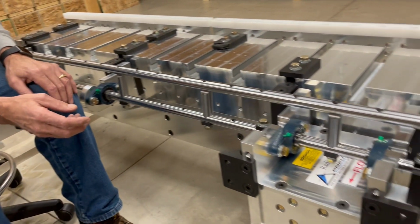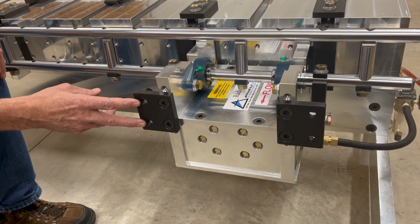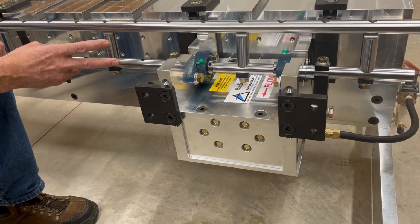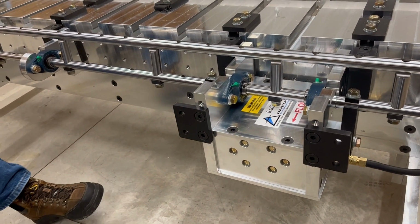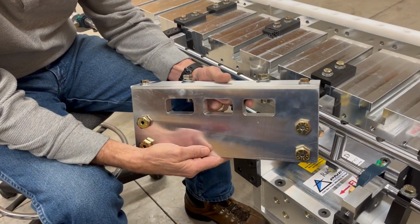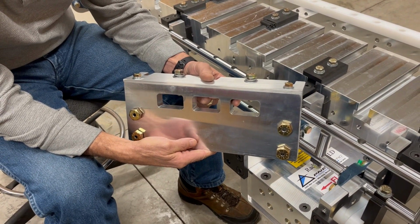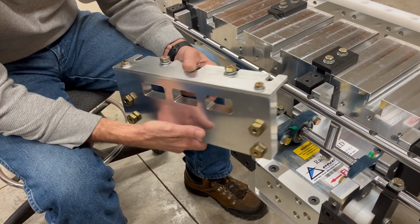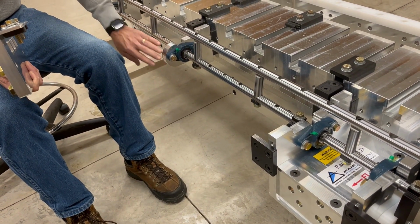But if you choose to purchase a system with faceplate mounting, you're going to need to drill and thread mounting holes in the face of your bolster. So with each Radial Pro system with faceplate mounts, we also include what is called a transfer drill template to assist you with locating and drilling the holes for mounting both the shaker drive and the pivot rack support assemblies.